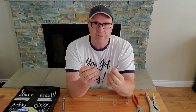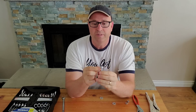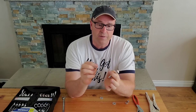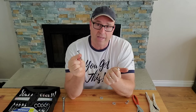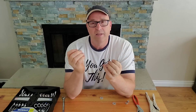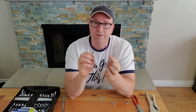Before we finish, I just wanted to quickly cover something I didn't address in the video — the difference between a regular bolt and a lag bolt. This bolt is kind of shiny, while this lag bolt has a dull finish. That dull finish is called galvanized — it's got a coating to protect it from the weather. So if you've got a project that's going to be outside, you want to go with galvanized bolts, nuts, and locking washers — everything galvanized — because it'll withstand the weather better. Anyway, thanks for tuning in and we'll see you next time on Tool Tuesday. God bless you.